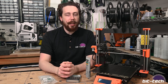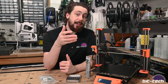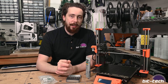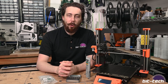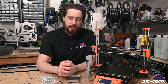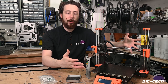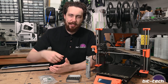One thing I was told pretty early on that I will echo: don't bother trying to print in ABS. Sure the printer can do it, but it's just not ideal because there is no enclosure, so you're going to have to either make one or buy one. Quite frankly, for the tiny gains over materials like nylon or PETG it's just not worth the hassle. I've had far more prints fail than succeed because without an enclosure you don't have even heat control across the entire build volume, so things warp and delaminate.